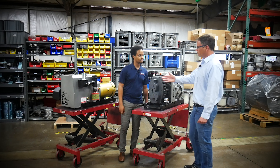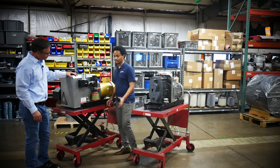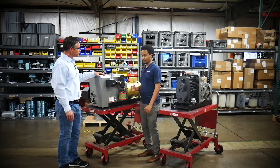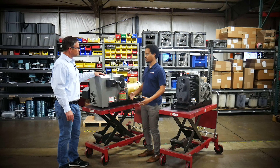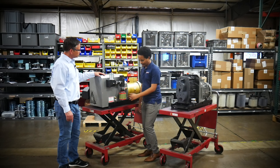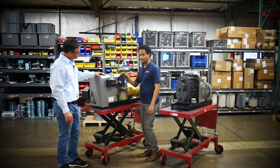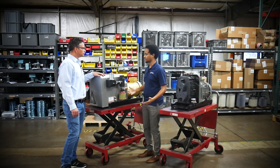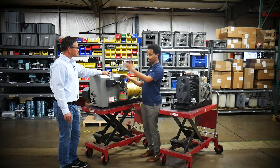We have one put together on this side, so take us through the outside. The inlet assembly here is integrated to all the pumps and it protects the pump from ingress of components and from getting clogged, because although the pumping chamber runs dry, you don't want your process gas to fill it with process particulate. There's a relief valve here that we manufacture, and what this does is give you adjustability so you can set it to your process and make sure you're not over-pressurizing the pump.